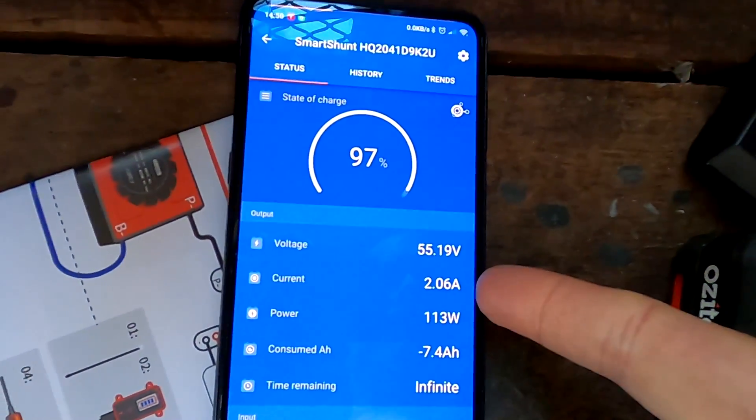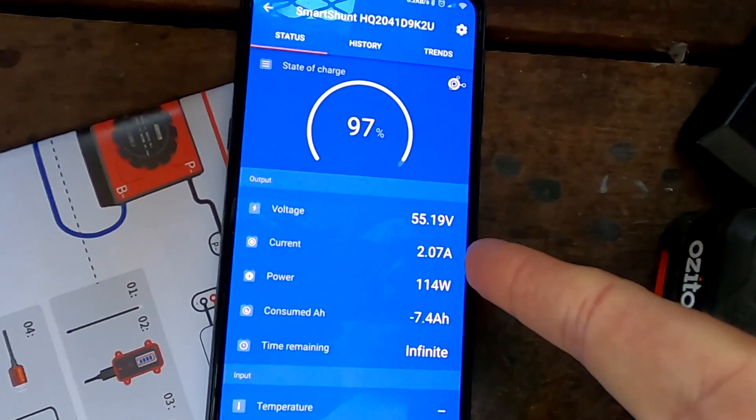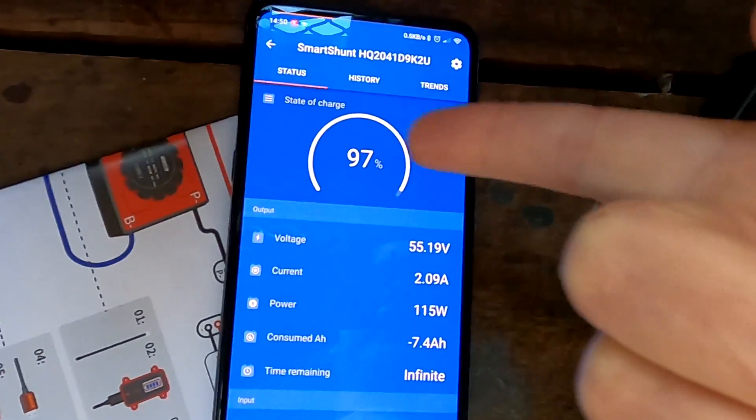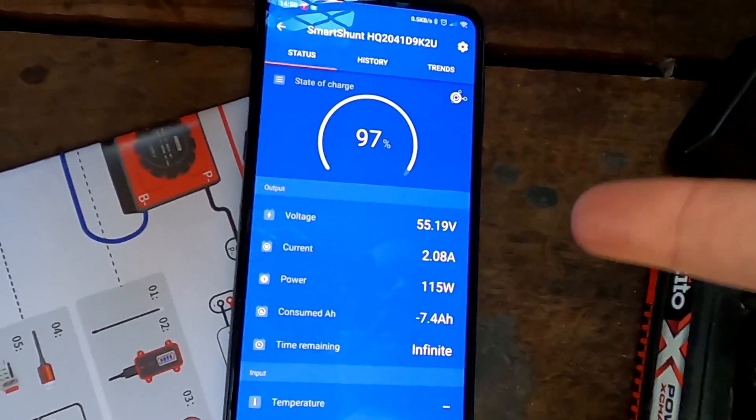After 15 to 16 days we have 45 millivolts deviation at 3.45 volts. If I charged higher now the deviation would get even larger. That's why smart people invented balancing and recalibration for the shunt. Obviously you need to recalibrate the smart shunt — nothing new. I just wanted to see how much drift we actually get: about two and a half percent in 16 days. The battery is still charging with about two amps and we are again at a very high state of charge.